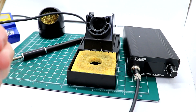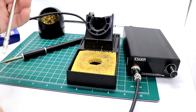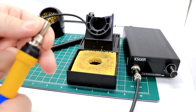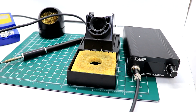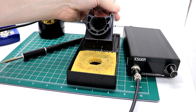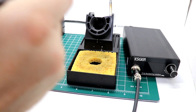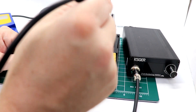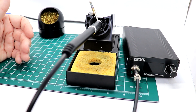I'm also going to remove the blade tip that we have on this one — this is the K tip, that's what it was. You can see how with the plastic handle you have to unscrew and screw it back together to change tips. Never set your soldering iron tips tip-down; try to set it tip-up. I'm going to use the same soldering iron stand I've been using — it can go all the way through, so I'll just set it like so to hold it when I am not soldering.